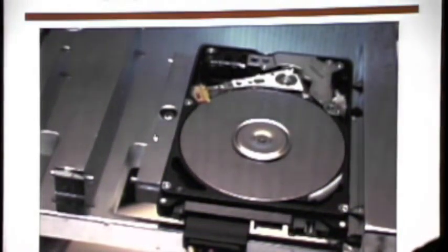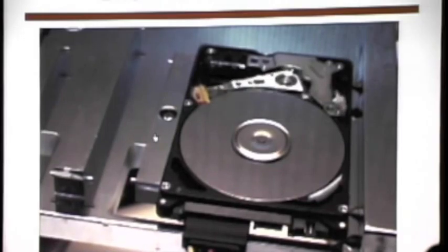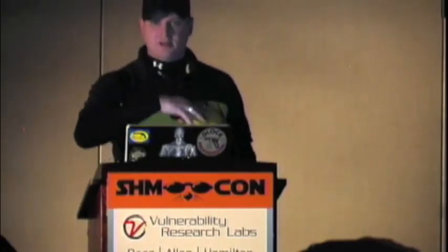Maybe I've actually got something else going on, like clicking. So here's the video — it'll do it twice. The head will move to this location and jiggle back and forth intentionally. It'll park again and do it again. The head will actually go to this seek area and jiggle ever so slightly, and you'll actually see it read the data. So that actually read the system area and then responded before it actually went to its park location. Now, if you open up a drive and see damage, it probably kept sending the head to that location, but there was some damage and it scratched the platter, so it never was able to read the system area. That system area is gone. It's very important to see it go to this location and intentionally jiggle. If it doesn't work, you'll get clicking and it'll never look like it went to the right location to read data. But the very first time it's powered on and goes through initialization, it's got to go try to read that system area.